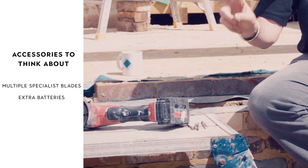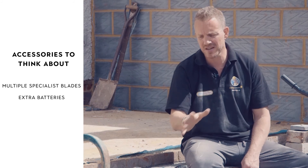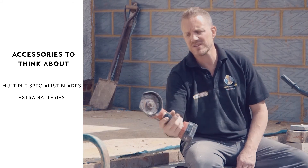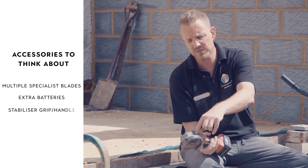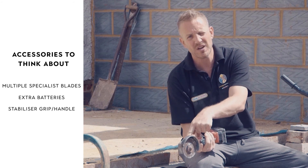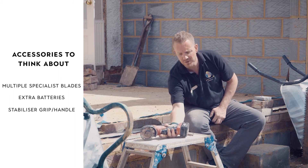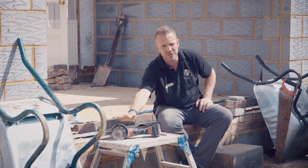Make sure you've got at least two batteries with a charger, so you've got one on the go and one being charged at all times. The other accessory worth noting — most grinders come with it — is a handle you can screw in when you need to apply more pressure for more forceful jobs. But I think the most important thing overall is using the right blade for different materials — don't get that bit wrong. So there we are, a comprehensive guide to buying an angle grinder. For more advice on tools, materials, techniques, and products for building, visit homebuilding.co.uk.